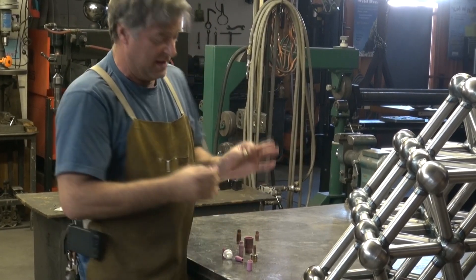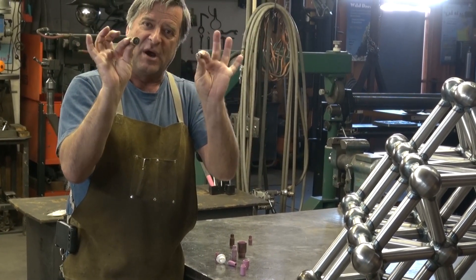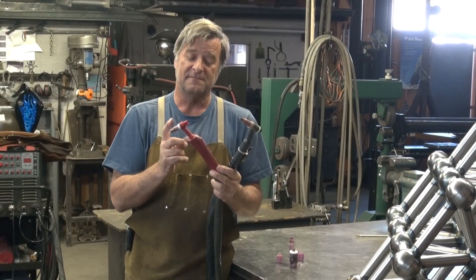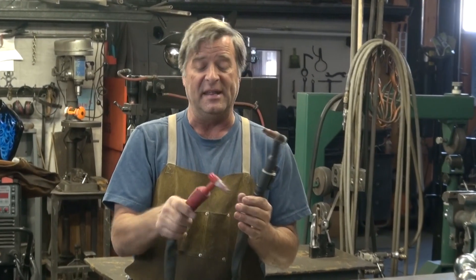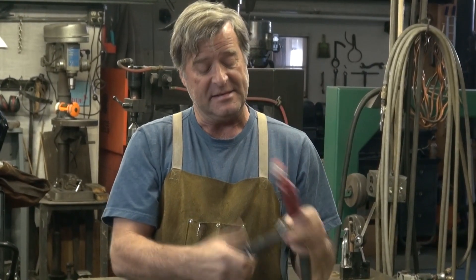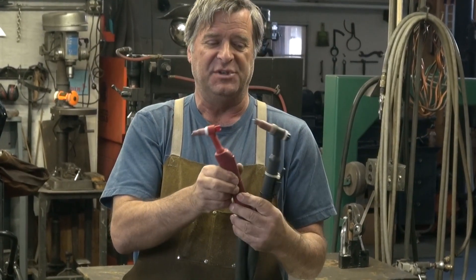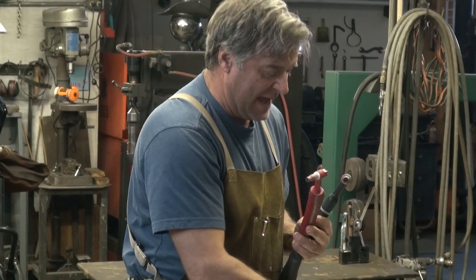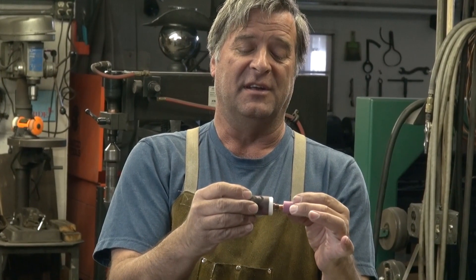I finally found a gas lens for my water-cooled torch. Same unit, same machine, same part — but you can see the difference in size between the two. Why would you even use the bigger gas lens? Because it fits the bigger torch. This is the WP-20, the water-cooled torch, and this is the WP-26F, the air-cooled or gas-cooled torch — no water in this one. You can see just the different sizes: bigger head, bigger handle, more heavy-duty. This big gas lens won't fit on this torch — it just won't screw in. If you look at the end where they screw into the torch, you can see they're just two different sizes.